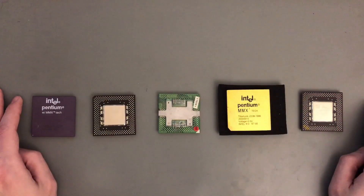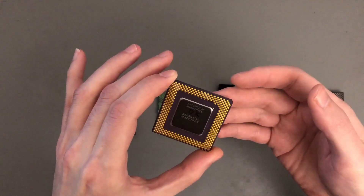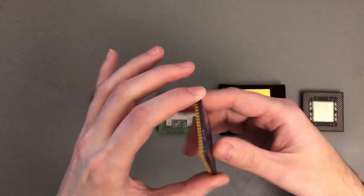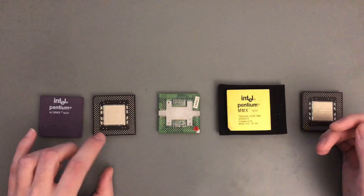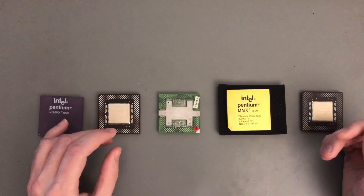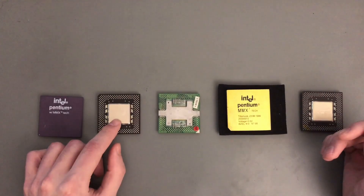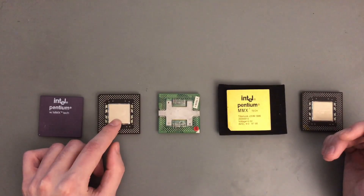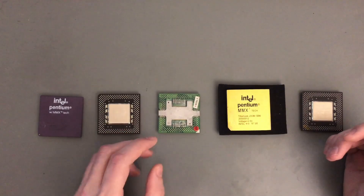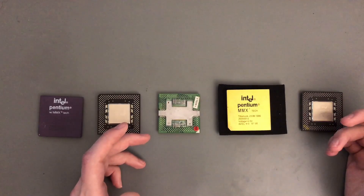So first let's have a look at the various types of Pentium MMX chips that were produced by Intel. The first Pentium MMX chips used a classic ceramic package, the same one used on the original Pentium. Then there's a newer package — the one I used back in the day. At some point Intel released the Tillamook core, which is basically the same core but shrunk down to a smaller technology node. Tillamook was only released for the mobile market, as back then Intel was heavily pushing the Pentium 2.